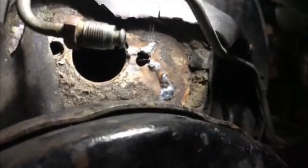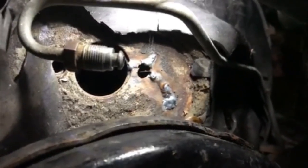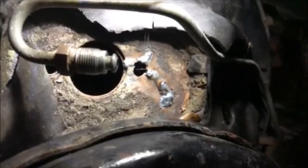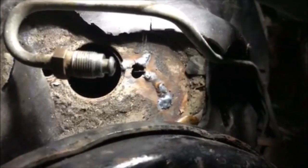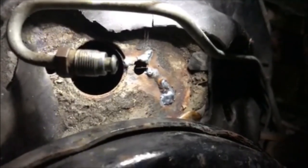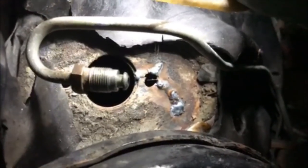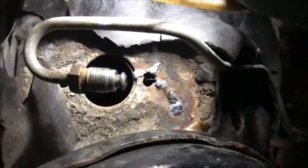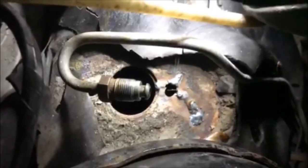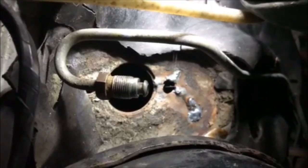I'm going to grab the welder. I was probably not going to weld it all up tonight because it's dark and the welder doesn't like humidity or bright LED lights - it reacts to those rather than the arc. But I got a bit carried away and decided to weld it. I've put quite a lot of heat in and concentrated on the areas where the crack had broken out. What's good is it didn't just go woof and make a big hole - it looked like it might be a bit frilly, but actually it's welded really nicely. At the top I've made a bigger hotter weld to pick up on that reinforcing plate on the inside.